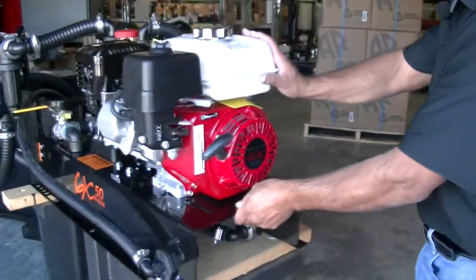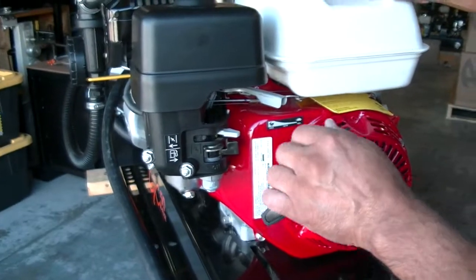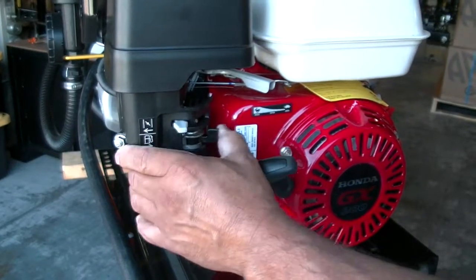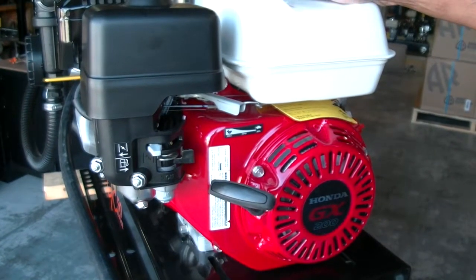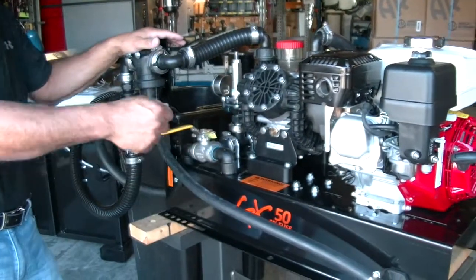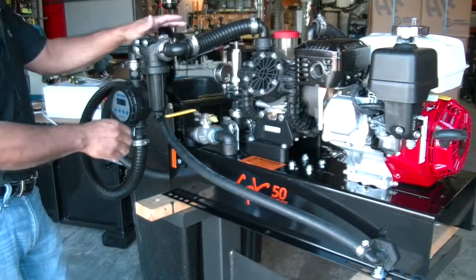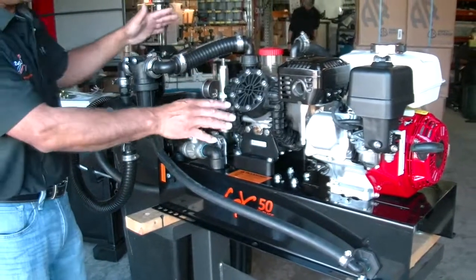On the gas engine itself, you have an on/off switch in the back. You also have your throttle — minimum and max — a choke for cold days, and your fuel on/off valve, which should be in the on position. These are one-pull starts and they work extremely well. Once started, remember you want the lever in bypass mode so that when you pull the engine it rotates through the system and circulates rather than going out to the nurse tank.